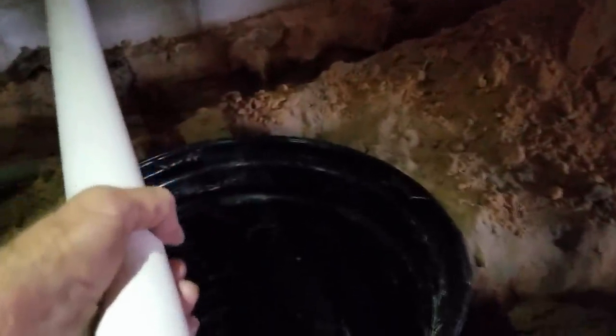What we need to do is, you can see the piece of pipe, I'm just going to lay it across so I can get a measurement of which block I'm going to drill through from the outside. Making that measurement is not that difficult at this point. I can use those vents and transfer the measurement from here to the outside and core right through the wall.